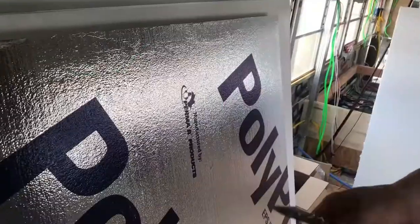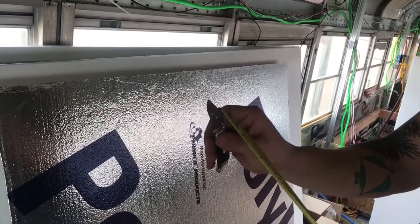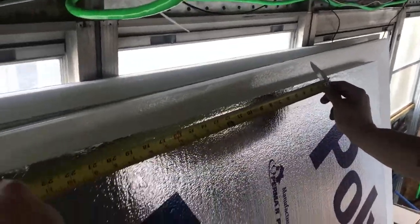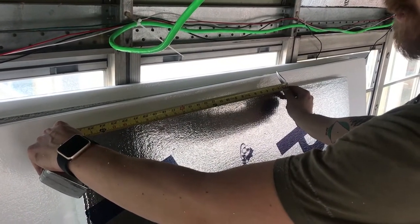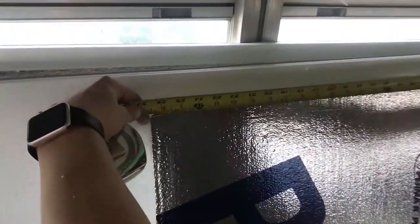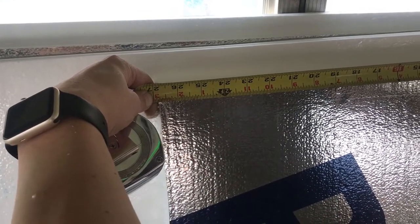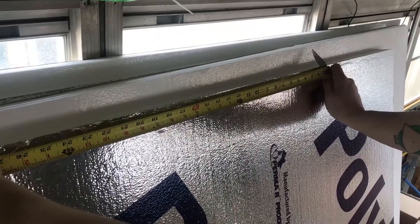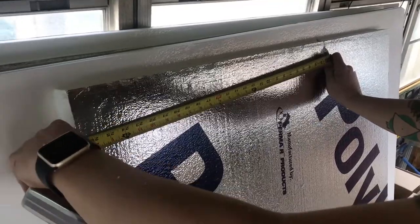Come on in close. I get a longer knife — I'm just using my regular pocket knife. I catch the knife on the end of the measuring tape, then come over to the board and pull it the length that I want. So right now I'm cutting pieces that are 26 inches and 5 eighths. I find 26 and 5 eighths right here on the end of the board, and I use my finger as a guide right on the side of the foam. The knife over here is cutting into the board as I go down using my finger as a guide.